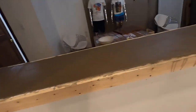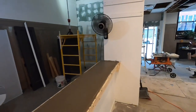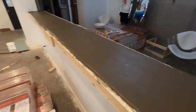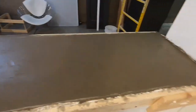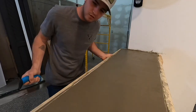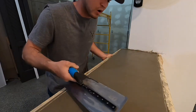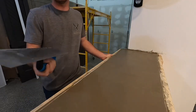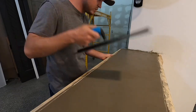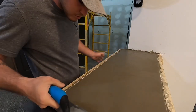All right, so I've been watching this set up for about six hours. I've got a fan blowing on it getting that water off the top — it's about ready to start burning. I wiped all the water off, fans are running, and I'm about ready to burn this. Burning means you rub it when it gets hard enough and it puts black streaks in it, making it really shiny and pretty. Be careful not to peel the top off — don't ever pick the trowel straight up. Always angle it.